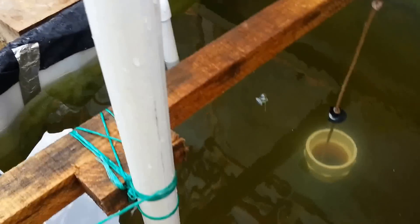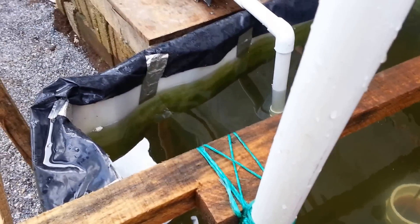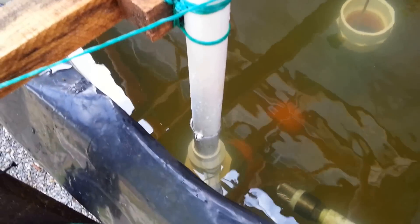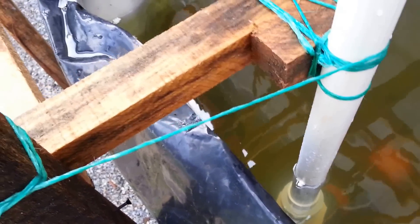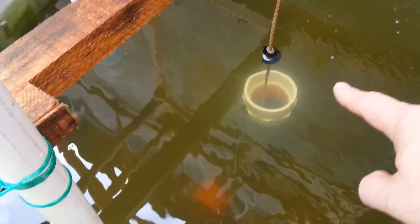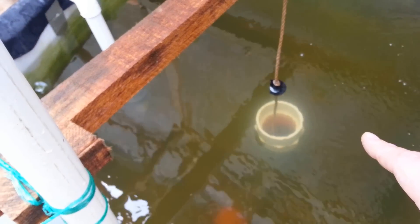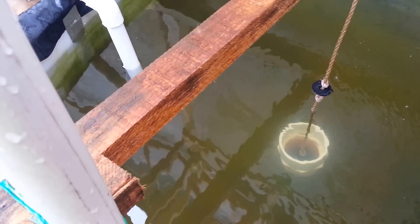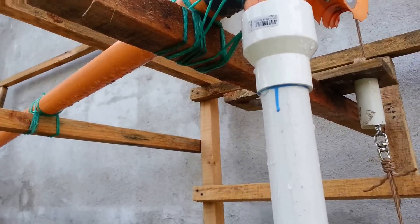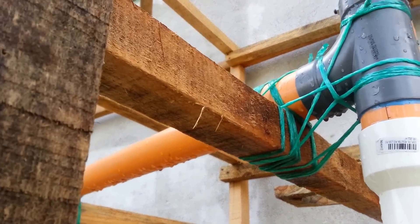What we kept fouling up on was that the knots would get hung up on the pipe going in. So I went to a four-inch connection down to three-inch, three-inch elbows that make the J, then a reducer from three-inch down to inch-and-a-quarter back up through the pipe. Basically the washer goes down, pushes water through the pipe, then lifts up — kind of an elevator action — into a Y that's two-inch. It needs to go bigger so you can handle the flow going back down.